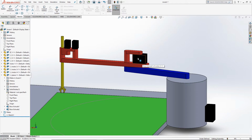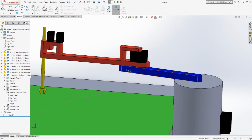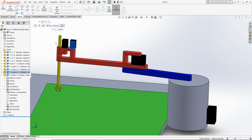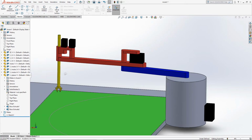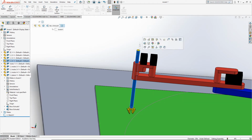And then we have a smaller gear ratio for motor number 2, because motor number 2 doesn't have to apply as much torque, because motor number 2 is not worried about moving this blue arm. So motor number 2 has a smaller load compared to motor number 1. And then finally, motor number 4 has the smallest load because it only constitutes this claw and anything that the claw picks up.